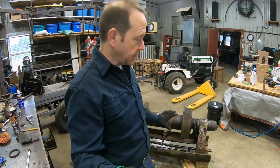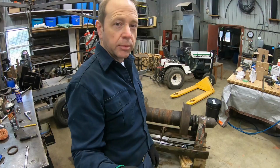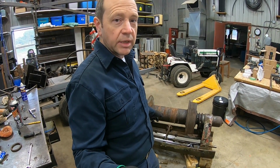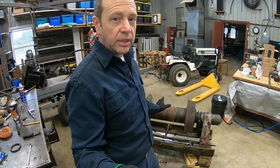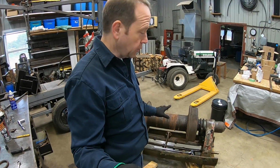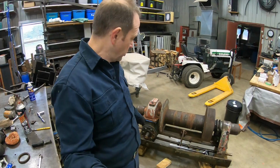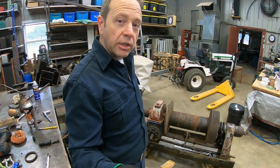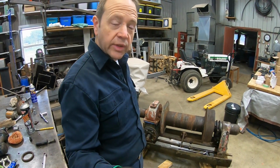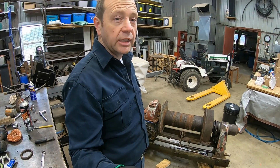So I did some research on that kind of winch. There's still a little bit of documentation available on that. From what I'm aware of, this kind of winch was made between the 50s and the 70s. When I got it, it was very, very full of rust, and the bearings were shot. The main thing that was good is the spur gear. I'm going to show you a picture of that. And the worm, they are pretty much like brand new, which is the key element for that.